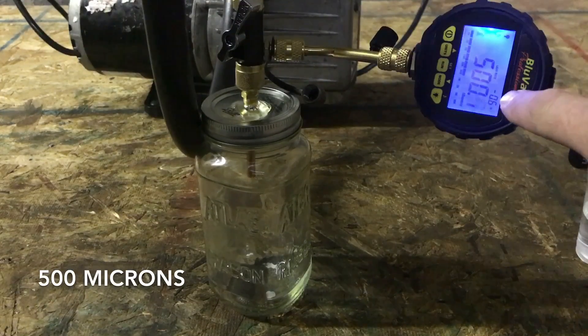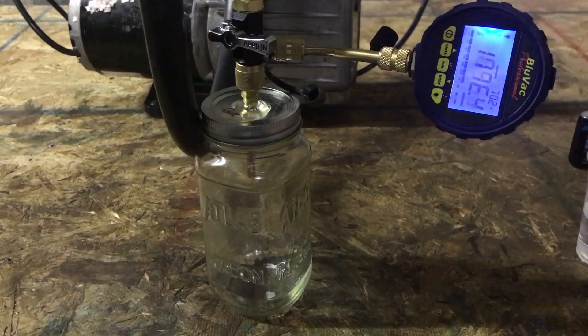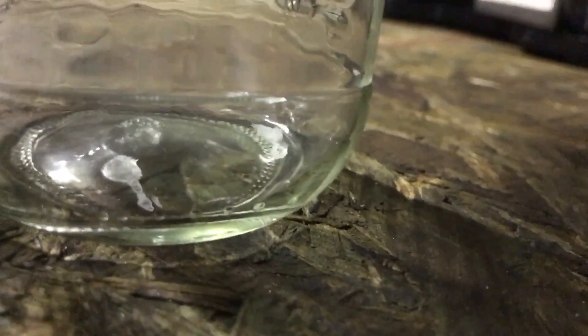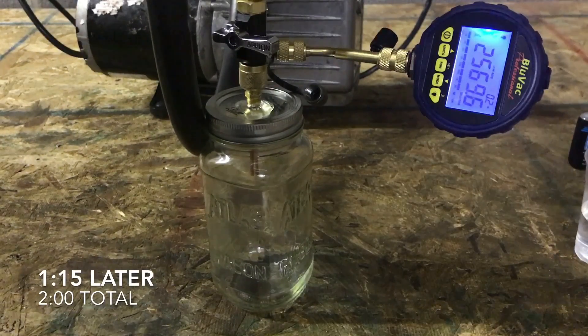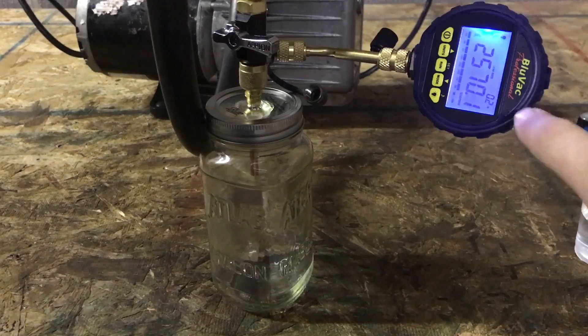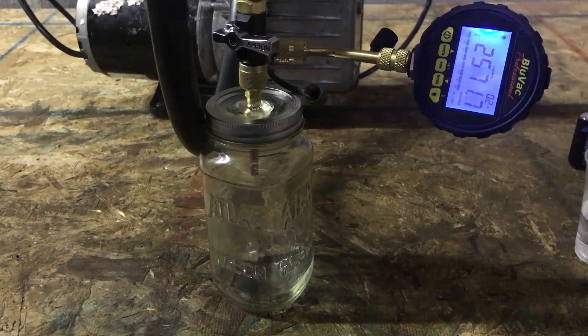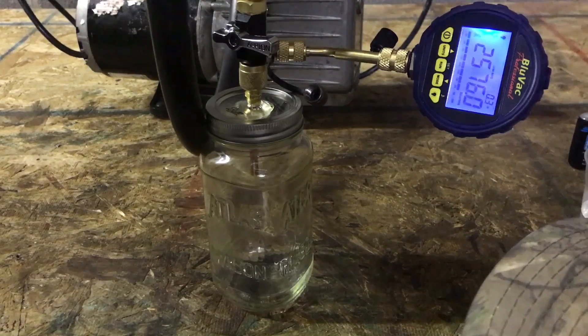You can notice right here. It's going down very slowly. We still have ice. We've almost stabilized here — if you can see right here, that is our leak rate. It's kind of stabilized where, if you were to have an actual leak, it would continue to rise, because the ice is starting to melt as well.